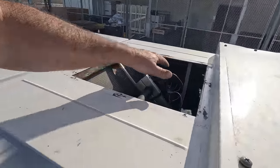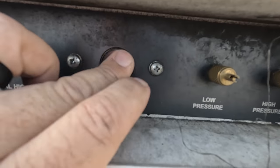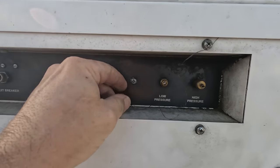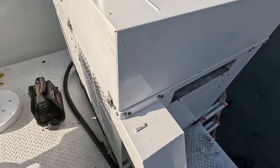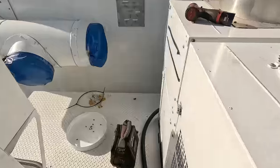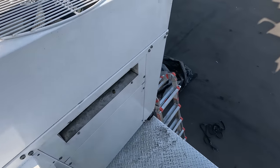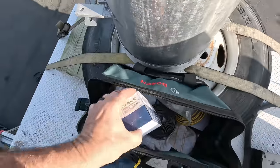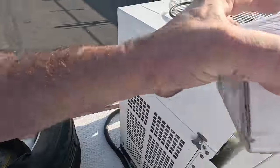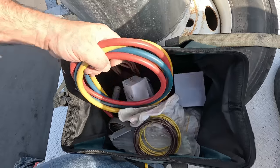Let's put it on cooling and see what this puppy dog does — cold air and hot air. Go over to our sight glass. This is running on 134A, so it does run really low. I did not tinker with the TXV at all. Superheat on the compressor is not bad — it's kind of on the high enough side where it needs to be. But the evaporator temperature is pretty low, lower than what I figured it should be. Didn't change anything. My bag of tricks here — I brought some universal contactors, transformer straps, some wire, more contactors and relays, and my gauges.